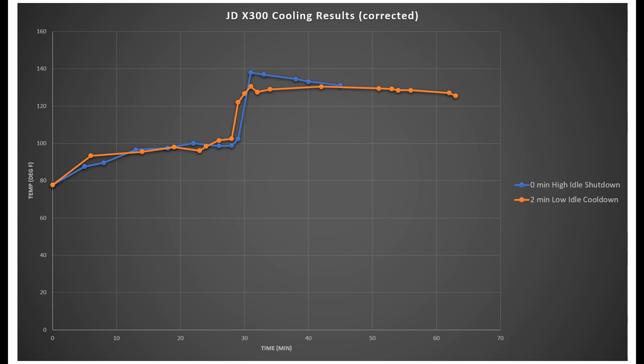So what's the end story? Idling for a couple minutes to help cool down — yeah, it helps. Is it significant? I don't know that it really is, and I don't know that it really helps anything. I think in this case you're okay just pulling into the garage and shutting the thing off. There was also an interesting trend on the second day: the temperature stabilized around 125–130 degrees for a long time, and I think that's the result of no wind — it was not very windy and there was no air moving in the garage. So maybe the best way to cool off a hot tractor is just to shut it off, open the hood, and leave it outside on a breezy day.